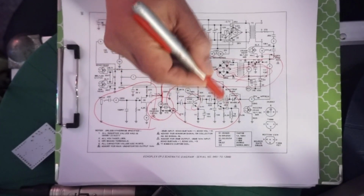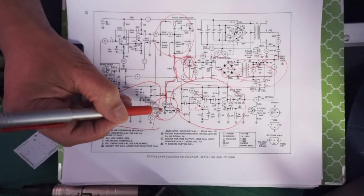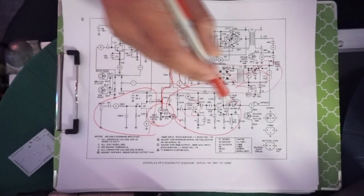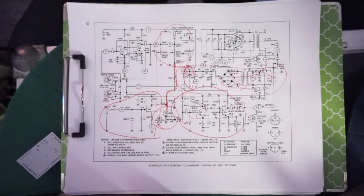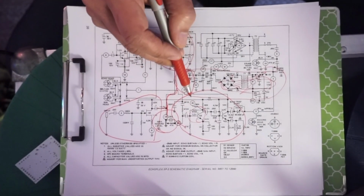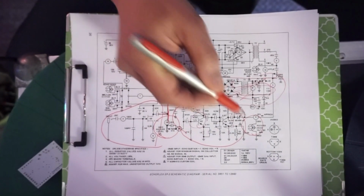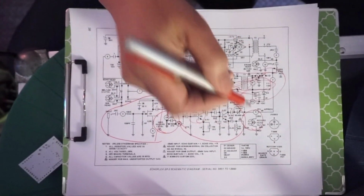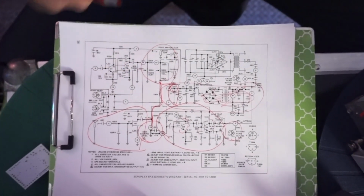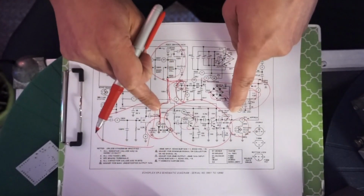But there's two transistors. And the point I want to make here is the record level pot is basically a pre-gain control to a discrete transistor gain stage, not that different than a lot of the dirt pedals and fuzz pedal circuits that are out there. And this is the record amplifier, and it drives the record head. But we don't have a record head on the Deluxe, so that's replaced with some circuitry I've developed to allow it to interface with the digital delay line. But this part is as close to accurate as I can get it,